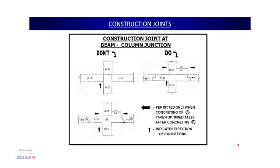Now, coming to the third figure, you can see when the concreting has been done from the bottom and spread to both sides, we can give a slanting joint at a distance of 300 mm, but this is only done in cases of immediate concreting. Suppose for a day we are doing the concreting and we stop, and it is expected to restart the work after 1 hour, we can do this kind of jointing. So, this is correct for only that purpose.